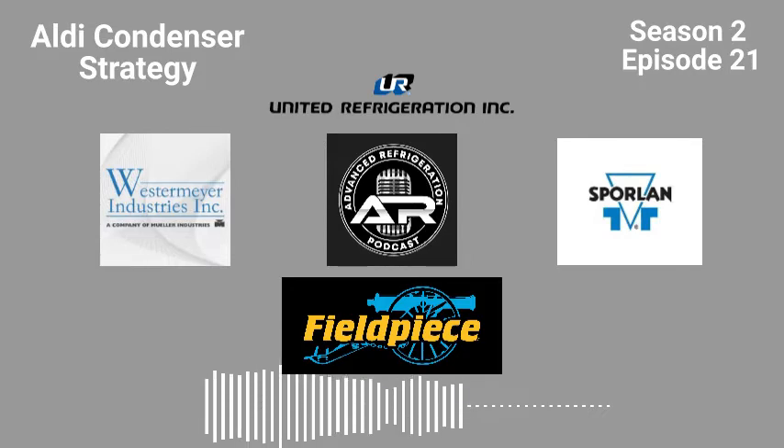We change it from capacity to temperature control and set the minimum capacity down to zero from Hussman's default of five. They have a temperature differential set point and a minimum temperature set point of 70°F, plus a temperature shift during reclaim. Most of the time these stores use heat reclaim via a CES unit — I've never seen a hot water Aldi. The CES unit is doing the heat reclaim. Whenever the store is open, it's shifted to 90°F condensing to maintain that level and get all that heat out.